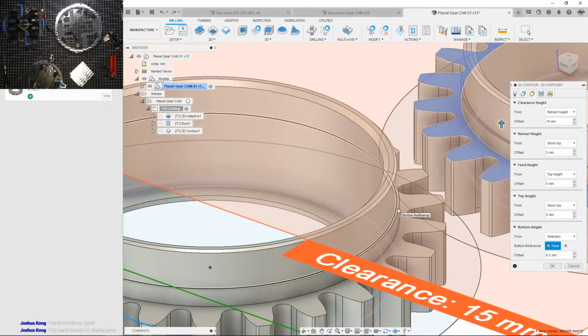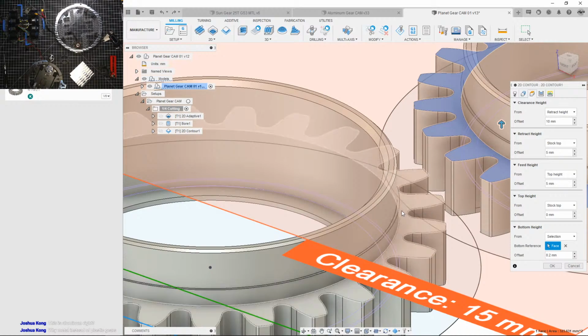Okay, so why metal instead of plastic gears? The way I have the gear interface with the motor bell is I have the motor bell pressed into the gear, and that surprisingly has been holding up really well compared to my plastic versions, because I don't know if you've seen my other fights, the plastic gears pop out, and so far, like on my 1 pound, the aluminum gear hasn't popped out yet. Fingers crossed it doesn't happen in any future fights, but so far it hasn't.